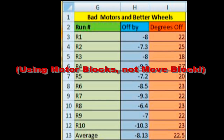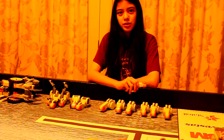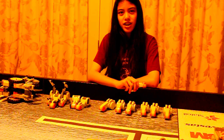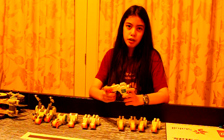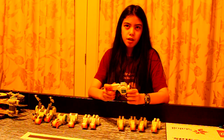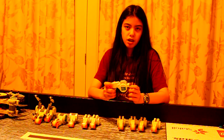Because our coach is a LEGO fanatic, we actually have 17 NXT motors. Comparing them all two at a time would be impractical, so we developed another method of characterizing each motor individually. We measured the time it takes for each motor to execute 10 revolutions at power levels 25, 50, 75, and 100, both in forward and reverse. We started by putting serial numbers on each motor, then made a program that automatically tests each motor at four speeds, forward and reverse, recording the eight time measurements on the display. Once we had data for all 17 motors, we compared them in an Excel spreadsheet to help identify motors that are closely matched over a range of speeds as well as in forward and reverse.